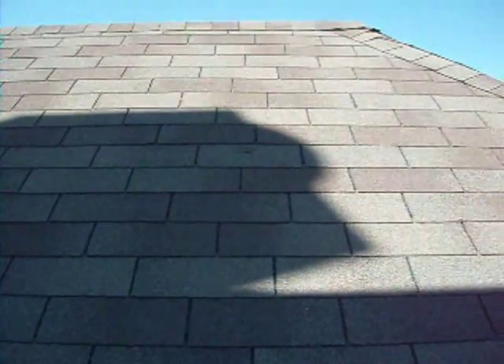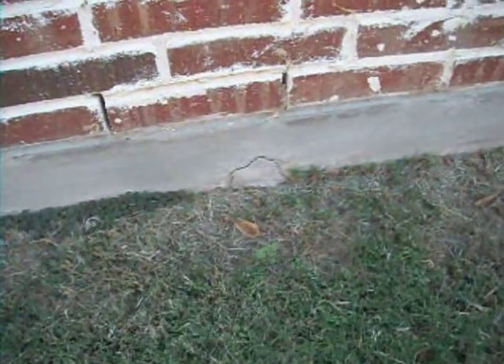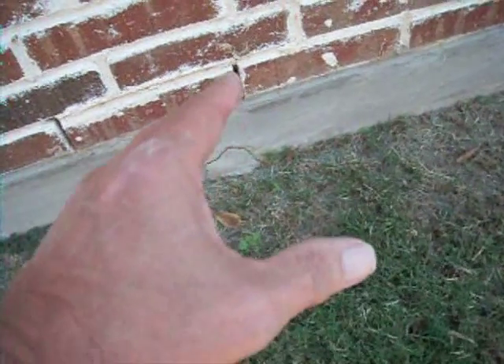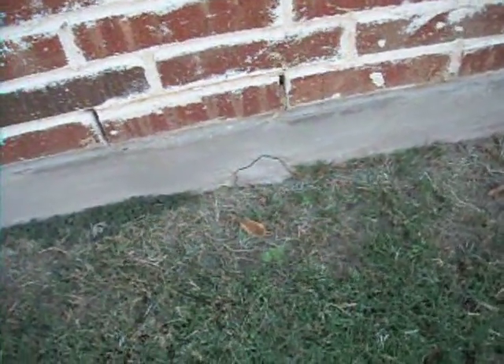I'm standing at the roof now, just over the porch or patio area, and I immediately see a problem — we've got a damaged shingle. This is a post-tension cable end and you can see it's popping out; the actual grouting is popping out. It needs to be re-grouted and sealed, because you don't want water getting in there — it rusts the post-tension cable ends.